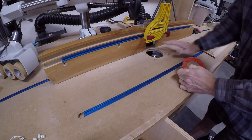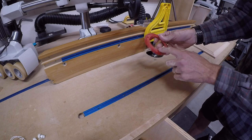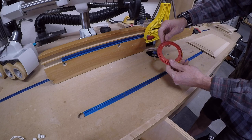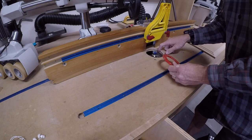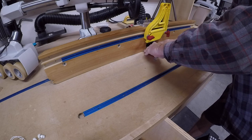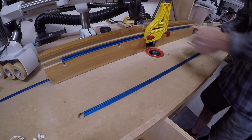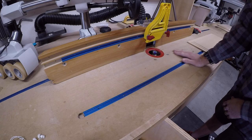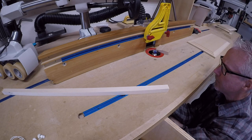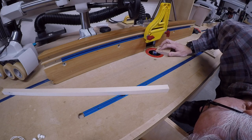So when I made this setup here, what I did was I made a hole and then I rabbeted it to fit this Rousseau plate. And I actually notched where it had little notches here. So I'm using the factory notches in this and then corresponding notches in the actual opening there. So it locks in there pretty nicely. It's a really good setup, I don't have to have some fancy plate, and nothing snags on anything. And that sample panel I'm going to use so I can make sure I get the setup right before I sacrifice one of my doors.